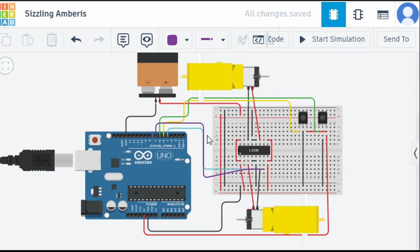Now we will connect our outputs also. Which is our input number 4, I'm going to connect upon pin number 1. From here I'm going to press and connect upon D1, and then change the color to pink. Then we have our last pin connection, which I'll connect directly to pin number 0. Let me change the color to brown, and I hope this is understandable.